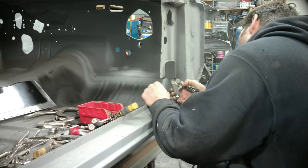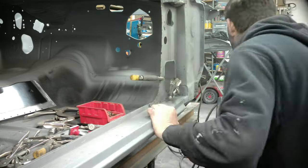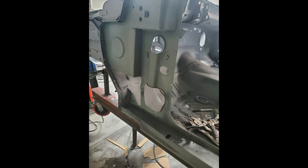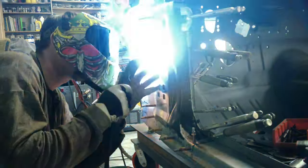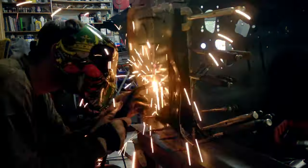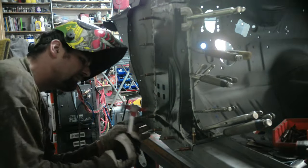Here's the piece I'm test fitting in - I made it just hammer and dolly. Again, it wasn't worth buying that whole piece. Skipping ahead, here's the passenger side and what I had to cut out of the other one. The piece I made on this side - same thing, hammer and dolly, just working the edges around. Fast forward, we're on the driver side now, just tacking in the side rocker panel over here. Both sides are exactly the same - the passenger side's already done, we're onto the driver side. It's the same process, just mirror it over, so you don't need to see the same process twice.